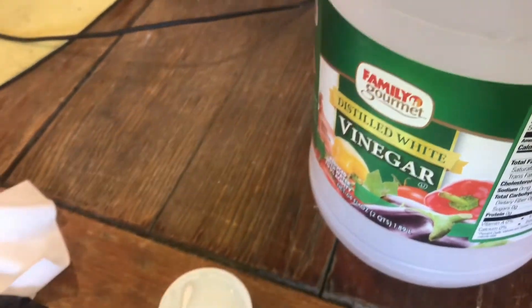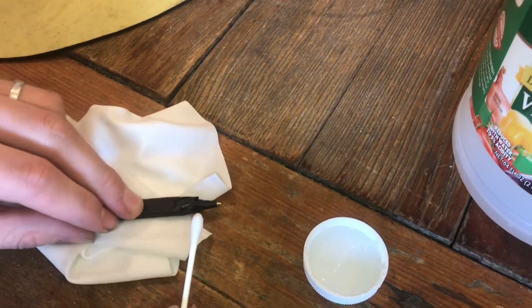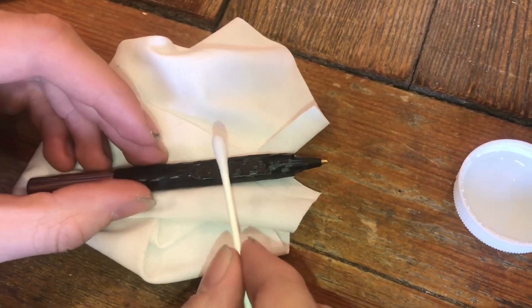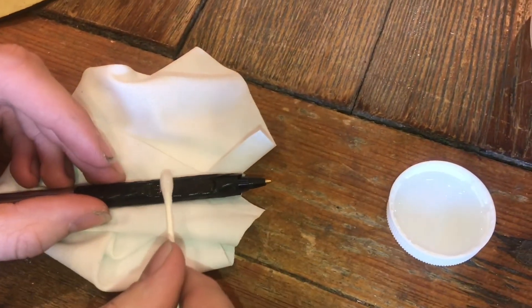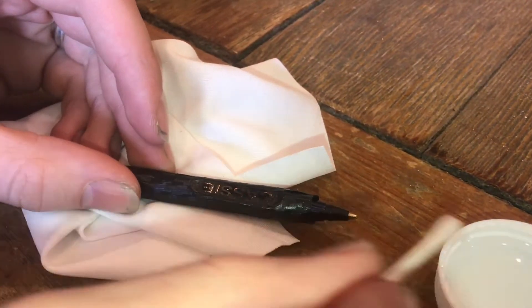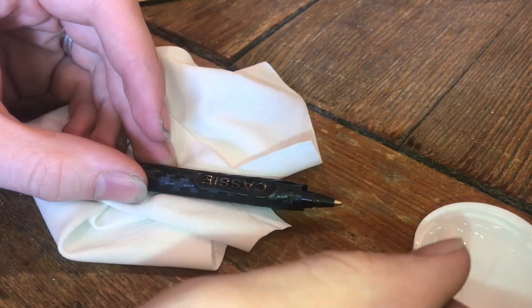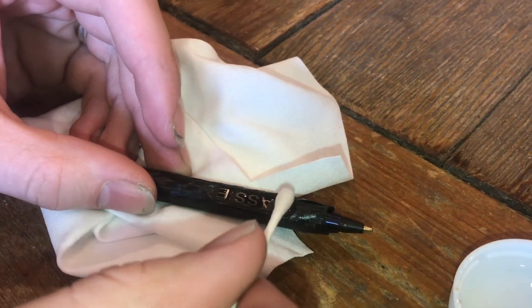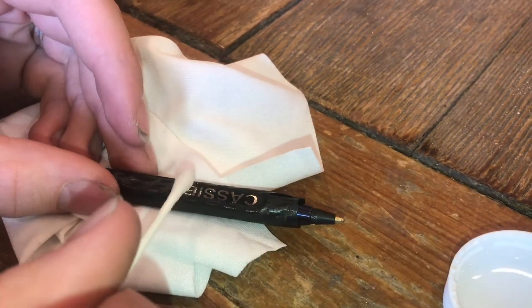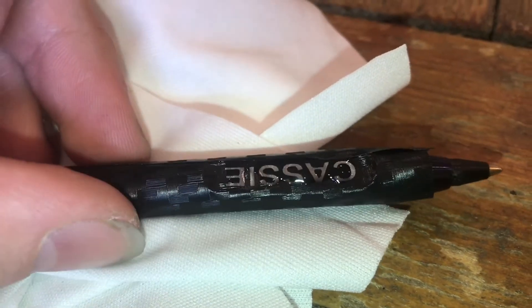This is just regular vinegar — nothing special about it. Normally I would put this in a vinegar bath, but I'm just going to try using a Q-tip. I'm confident that all the vinyl is fully stuck, because if anything is not sealed then the vinegar could seep through and contaminate the rest of it. I'm just going to apply the vinegar on the surface and we should see all of the colorization fade away. When it's all silver I can dry it off. In probably less than 30 seconds all the vinegar has dissolved the blue away, so I'm going to rinse this off.